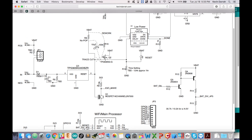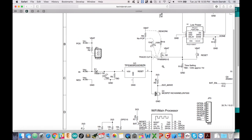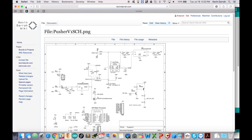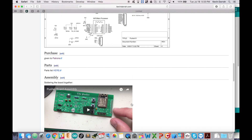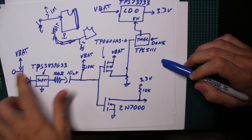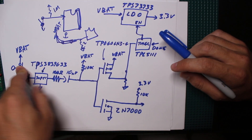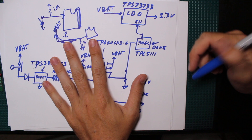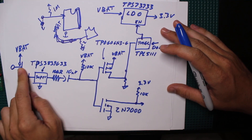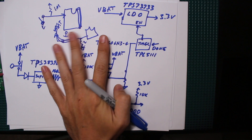The schematic has some errors — the P-channel MOSFET is drawn in backwards, a rookie mistake. All those reworks are documented in the wiki. A version 2 schematic will be published shortly with additional features: it can monitor not only normally-closed inputs but also normally-open inputs. So whether a flood sensor closes when triggered or opens, you can monitor both, with sub-1-microamp sleep current in either contact state.